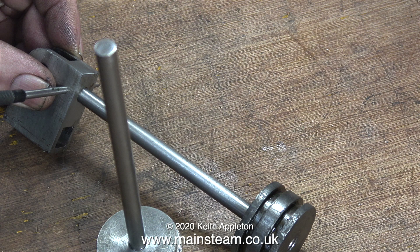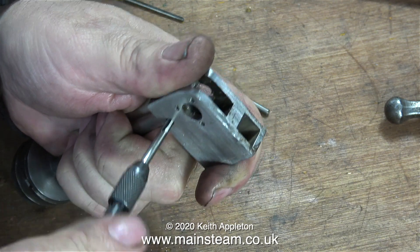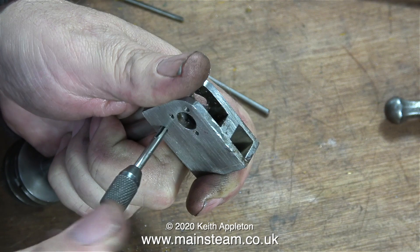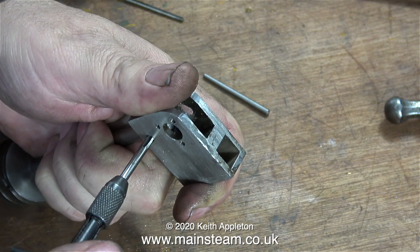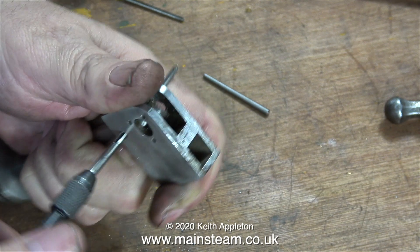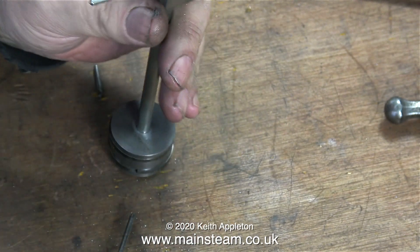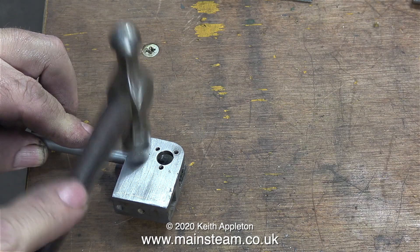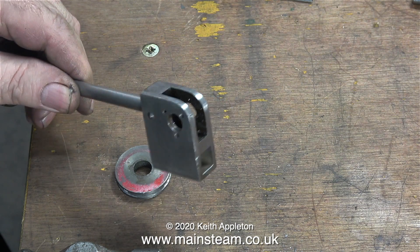In this clip I'm using my scriber to check the position of the hole in the piston rod using the old piston and rod as a guide. After which I fitted the new piston rod into the cross head and drilled all the way through five thirty-seconds of an inch, and here I'm very carefully using a five thirty-seconds taper reamer. A word of caution: if you push the reamer all the way through, the thick end of the taper pin will be level with or below the hole in the cross head. The taper pin I'm using is far too long, so I'm cutting it off so the thicker part is just above the level of the cross head, and the other end is accessible so you can tap it out if needed.